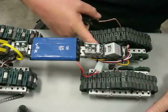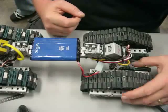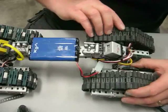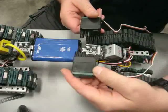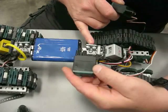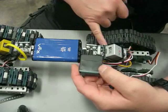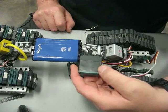What I'm going to do tonight is mechanize these pivots down here. I've been trying to avoid this like the plague, but there is no other option at this point. The elastic bands work, but they're more of a liability than an asset. So I'm going to have to mechanize these pivots. What I plan on doing is mounting these servos up around this area right here, and then drive them with a chain to gears down in here. So I'm going to start taking this stuff apart and see how it goes.